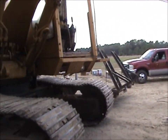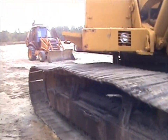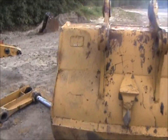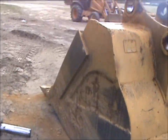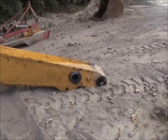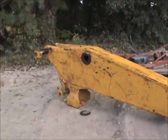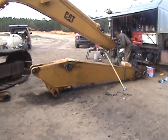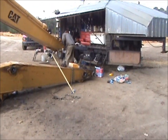You don't really notice the play when you're loading trucks, but if you're trying to do fine work or clearing it really hammers on those bores and will do a lot of damage. I bought the bucket from a friend of mine and he loaned me a stick that had decent bushings so I could get by until Scott could come down and do the line boring.